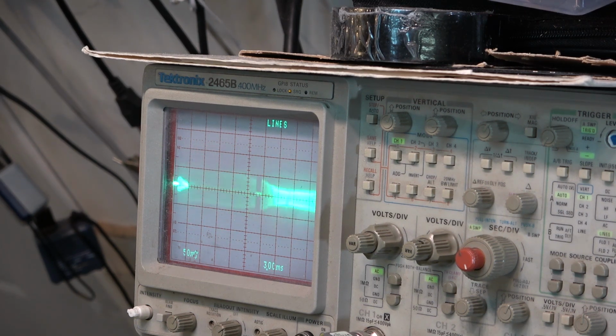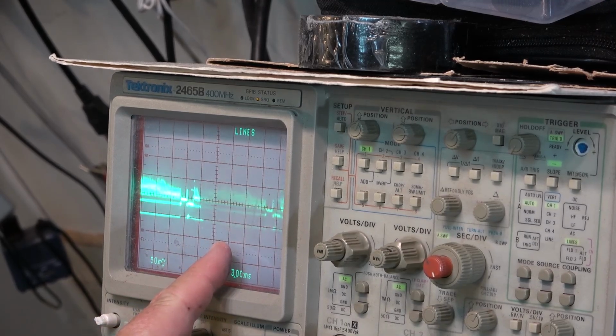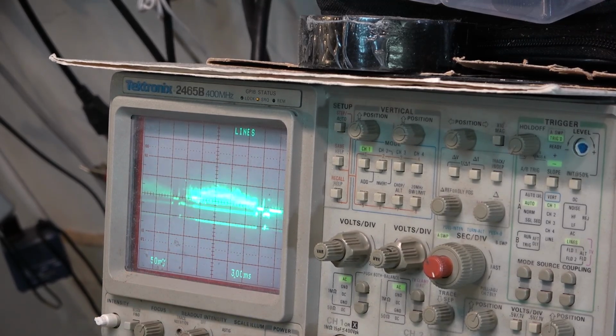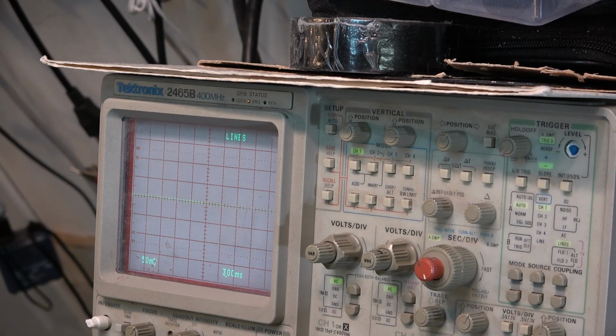Trying to play the analog tape. But that's video. I got video on one of the boards. When I play back an SX tape, that's what I'm seeing on that test point that was giving me video from the analog tape, although I do have a picture, an image on the screen here, just a frozen image with a bunch of blocks on it.